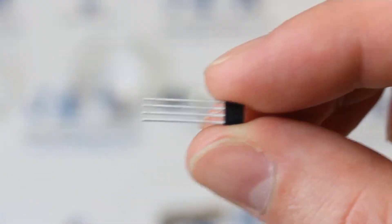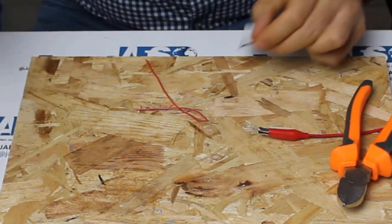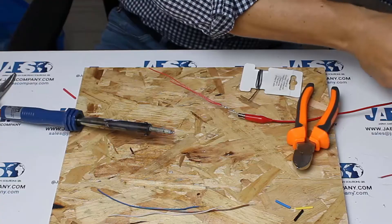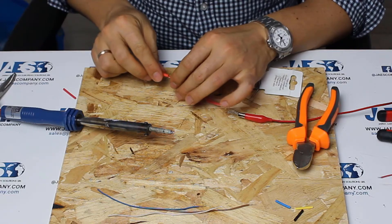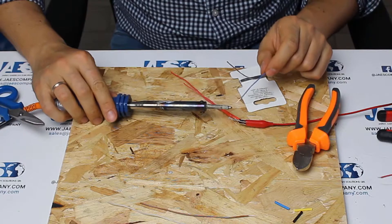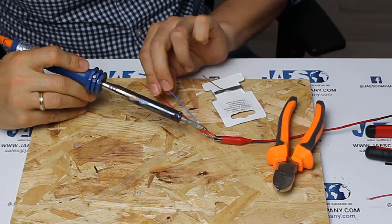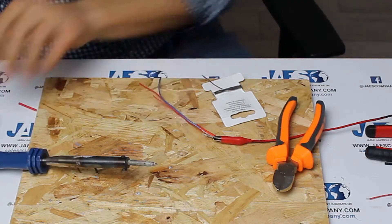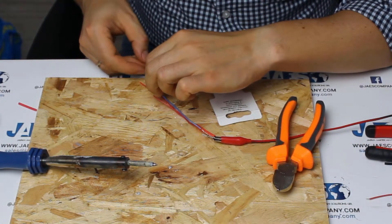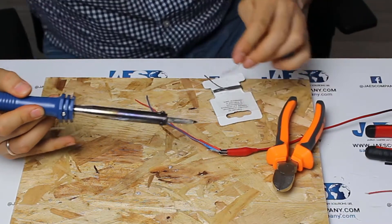Now, we connect four cables to the four terminals of a Hall effect sensor. The Hall effect sensor is a device used to measure the magnitude of a magnetic field. Its output voltage is directly proportional to the magnetic field strength through it. So, the circuit AH-266, driven by this sensor, will alternately pass the current on the two windings whenever the sensor changes the magnetic flux to which it's subjected. Since windings create opposite poles when crossed by the current, there will be a continuous inversion of polarity in the electromagnets that will repel or attract the permanent magnets of the rotor, all in a synchronized way. That's because the magnets of the rotor will drive the Hall effect sensor.